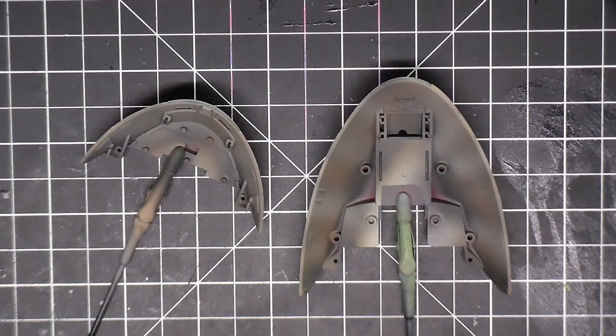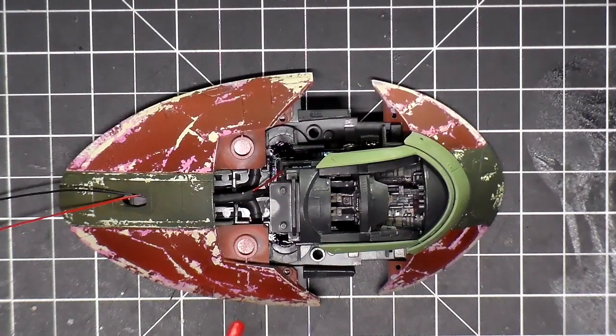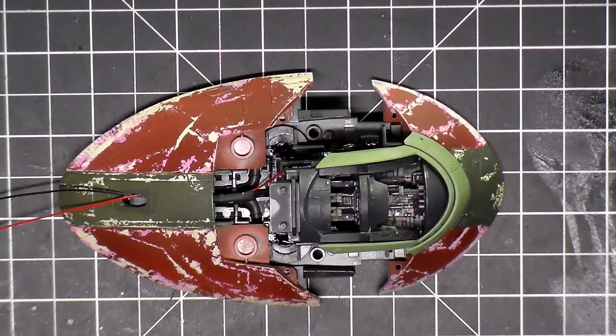So now I need to do the wiring, and I'll be back. I have joined all the wires into just one positive and one negative. It's all soldered, and I did some shrink tube. I also cut a little slot out here so it would lay as flat as possible. I will 5-minute epoxy this in here so it doesn't go anywhere. When I have to stick the rod in there, I don't want anything moving around or taking any chances on anything breaking.